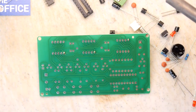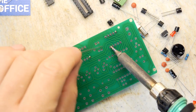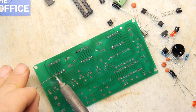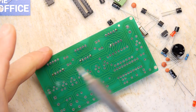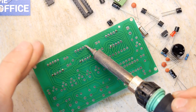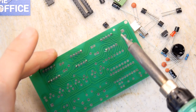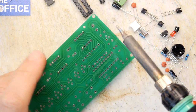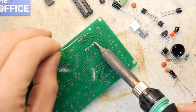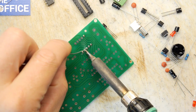And you'll normally know by the way that the resistors are, because if you want them to be constantly bright, each IO line effectively will need a resistor for the LED. If they're being a bit lazy, they might just have one resistor for the whole ground of all of the LEDs, or the voltage source, depending on how the seven segment is wired. And you'll notice that, because as you get more and more segments showing on the screen, they'll get dimmer and dimmer. But judging from the massive pack of resistors that have come with this, they've probably gone for a resistor each.